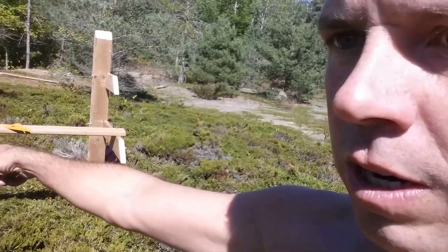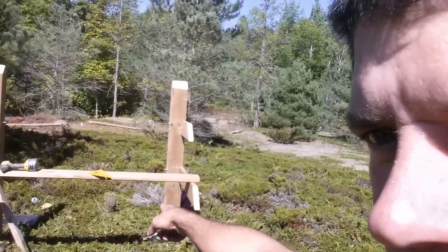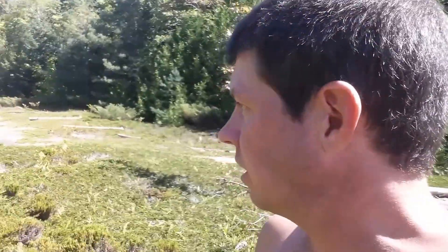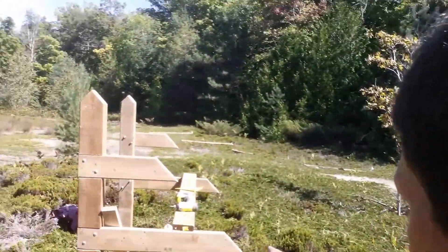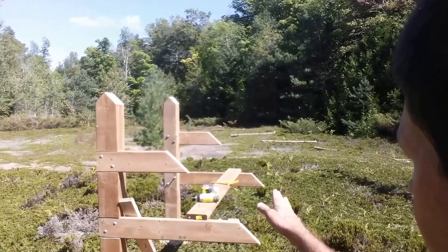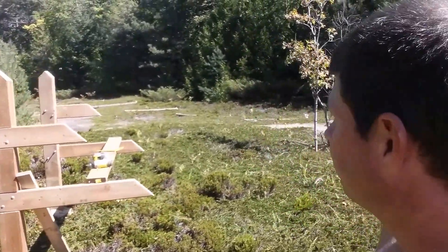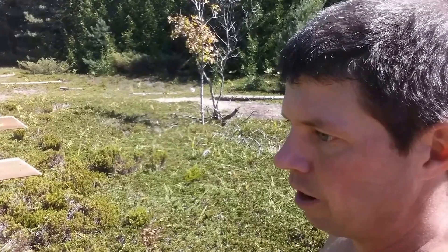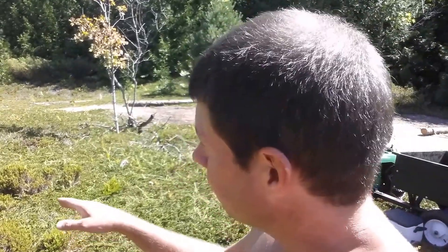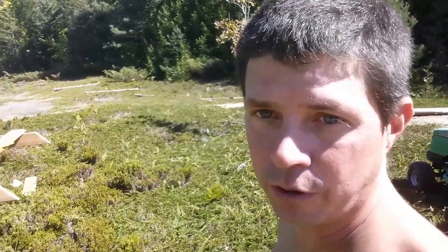Quick update. I've got the two uprights in — one there, one there. They're in and leveled, facing south. On the edges here, there are three rails that are going to go across from one point to the other, and those are cut on 45 degree angles. The reason they're 45 is where we are, our latitude is pretty close to 45 degrees — we're 44.8 or something like that. For a rack mount system, one that doesn't track the sun, you're supposed to set it at whatever your latitude is. I'm going to get these verticals on and then we're going to start mounting some solar panels.